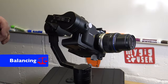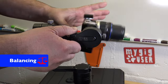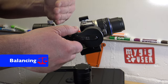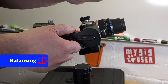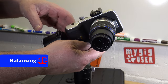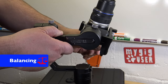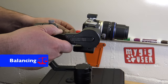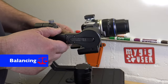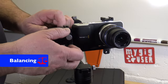The goal here is to make the camera not bounce around like on a scale where there is too much weight on one side, swinging back and forth. We want to change that by moving the camera forward or backward. We start out with the first motor — the motor closest to the camera. So I move it a whole bunch forward and we see that it doesn't do this anymore. You can also change the position of the camera higher or lower towards the motor axis, and that would be the next step to get it higher so that it doesn't do this swinging behavior.